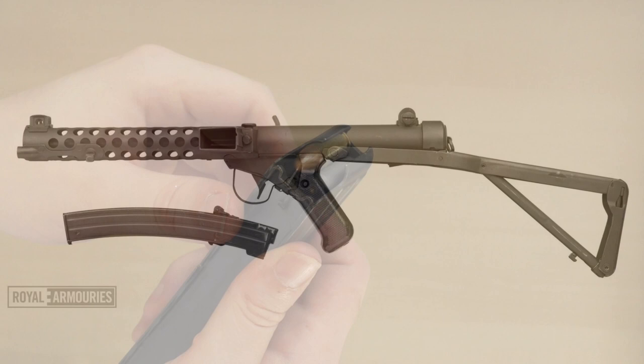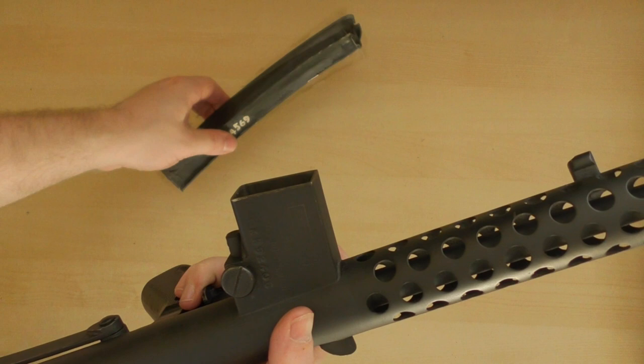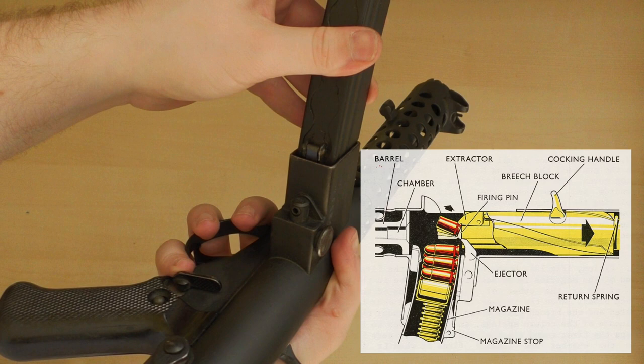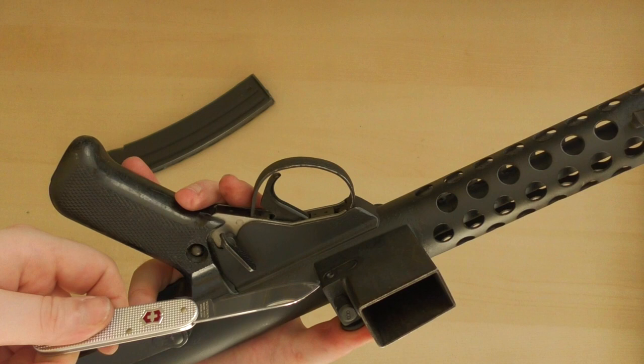Let's take a closer look at how the magazine interacts with the weapon. On the front of the magazine is an over-insertion stop built into the edge of the magazine body. At the rear is another magazine stop with a flat spring, which is designed to limit rattle and helps to properly align the magazine in the breech for optimal feeding. With our patented Swiss pointing device we can see the base of the magazine catch, which interfaces with the magazine. The magazine release button is wide and quite ergonomic, and we can see from this angle how the magazine housing is angled forward.